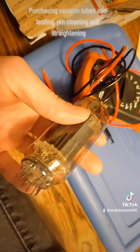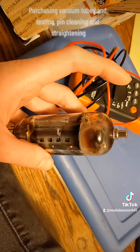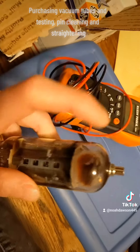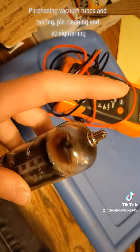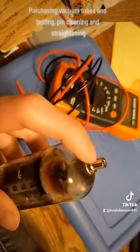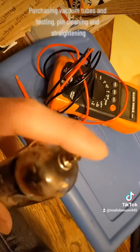This one is the tube I pulled out of the Ford Philco. It completely went to air — it is bad — and you know because the getters are just gone. On this side it was arcing and left a horrible burn mark, and then there's the top here. When you're working on these TVs, do not mess around with this, especially when it's on, because you will get a nasty zap.